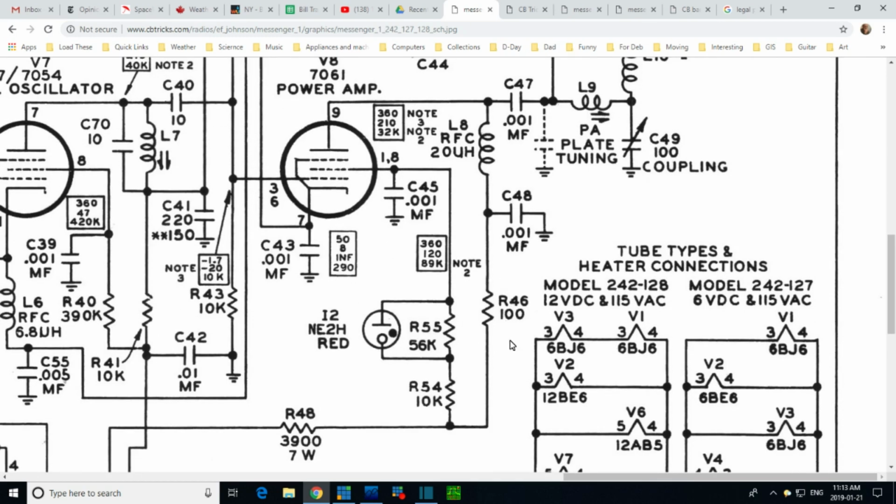So I think across this resistor. If we read it further on, we'll have this screen current in here. We don't want that happening. Got to find R46 in the radio and put a meter across it. Now, wait a minute, this is DC, that's right. And I started thinking, wait a minute, this is 27 megahertz coming through here, but no, DC there. Okay, well, I gotta find R46. Boy, if I can just get R46, get the equipment set up today, that'd be great. R46, let's go hunting.